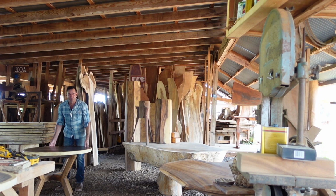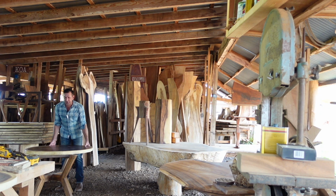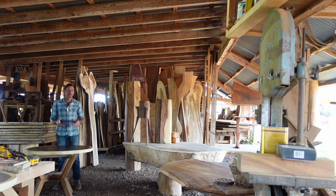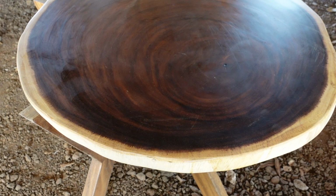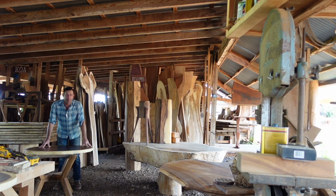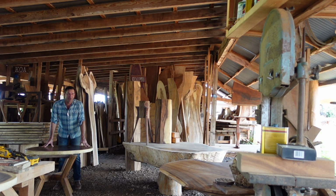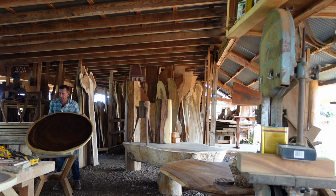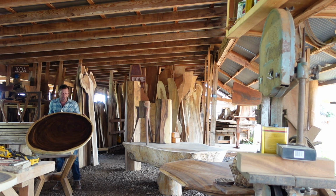This is one we're making for a crouching lion. And typically, we always cut along the long way of a log. We rarely do a cross cut, basically because that cross cut tends to be a bit more brittle, so they can snap easily because you don't have that continuous grain. But in this case, this was a tree that was removed from behind the client's house, and the crane operator felt nervous about moving this 10,000-pound log over the house. So they cut it into smaller sections. What that meant is we were able to get these cross-cut sections.